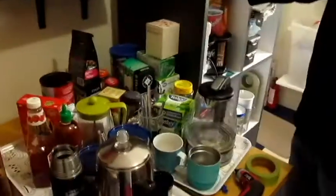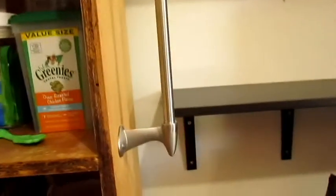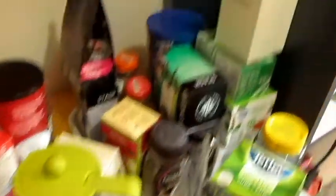Basically, that's how you do it. The key when you're putting on a shelf is that I usually like to do at least one of the supporting brackets on a 2x4. And then, like I said, because the stud was in the middle, we did three. It's very secure on this one here as far as weight goes, and the other ones are just supporting — not likely with the anchors that they'll fall off. Especially since the weight on the shelf will probably be not more than 10 pounds — we've only got the empty coffee carafe and all the teas.